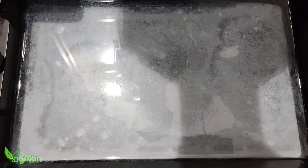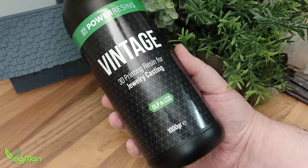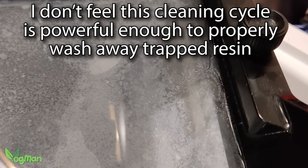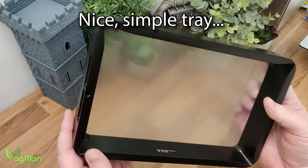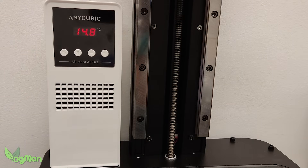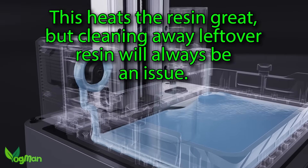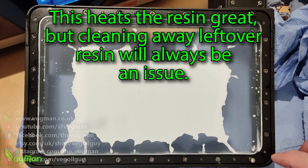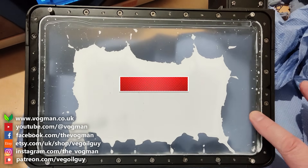Now this may be fine in most cases, but if like me you have a $300 bottle of castable resin, you don't want anything contaminating and spoiling that. So I'm sorry to say my view of the heating system on the M7 Pro has now dropped considerably, as it seems heating only takes place through the resin. A simple standalone heater like the one we saw on the M5S Pro is far superior in my mind, and I would urge Anycubic to return to that simple and basic concept. And that ends my confession, apology and correction video guys. If any of you have any questions on this issue, please don't hesitate to get in touch and I'll do my best to help. So take care guys and thanks for watching.